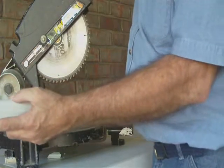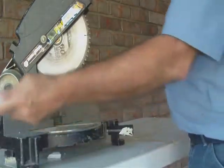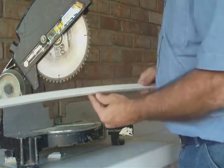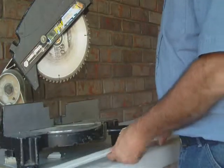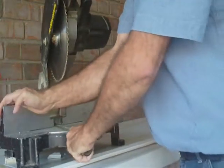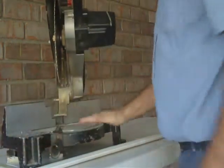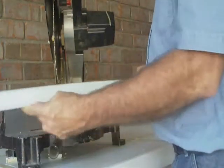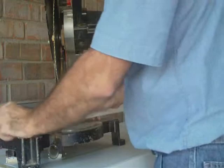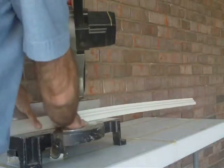47 and a quarter, because it's going to add a quarter of an inch for a good bend into the corner to make sure it fits snugly. I made this cut here, I'm going to measure 47 and an eighth all the way down over here, and I've got my mark right there. Then what I'm going to do is turn my miter saw blade the other direction — take it and turn it to the other 45 degrees. Now I'm going to take the mark that I've got, turn the molding upside down, and I've got my mark right here. And this is where I make my cut.